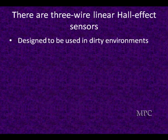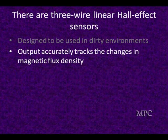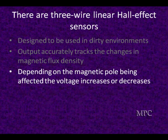The other thing we need to remember is we have some three-wire linear Hall-effect sensors. They're used in dirty environments — you'll see these in pickup trucks and places where there's construction equipment in very dirty environments. The output accurately tracks changes in flux density and doesn't suffer much from contamination or dirt. The voltage increases or decreases depending on whether you're going away from or toward the magnetic pole — north or south.